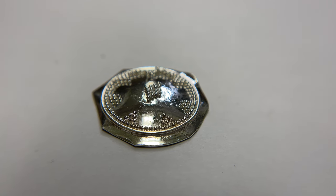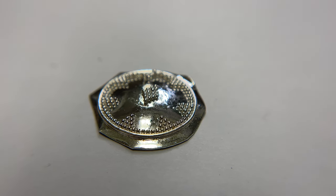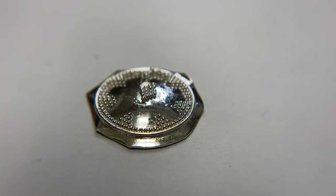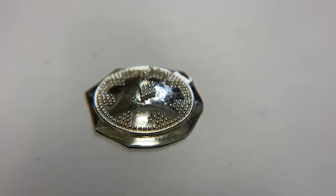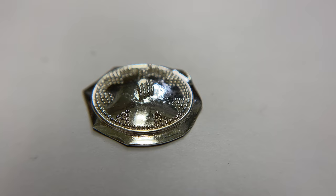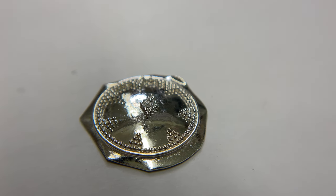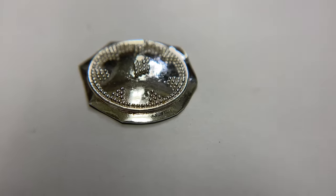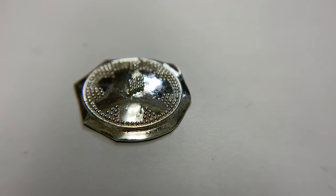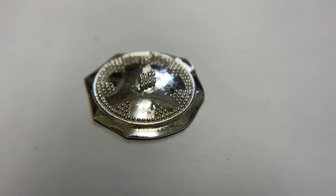When checking granulation, I tilt it under my magnifier and look for what we call a 'neck' — a tiny connection of metal between the granule and the back sheet. You'll also see little connections between some of the granules, which helps. But what you must confirm is the connection between each granule and the back sheet, because if granules are only connected to each other but not to the sheet, they could just peel off in a section. I believe these are all beautifully attached. We'll take it under the magnifier and slowly tilt it to look under each cluster and confirm the connections.